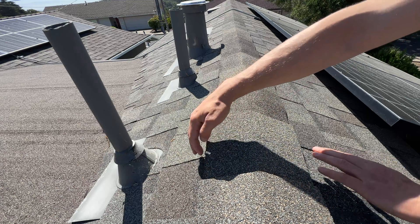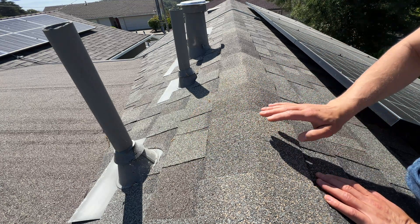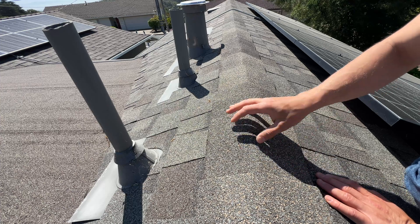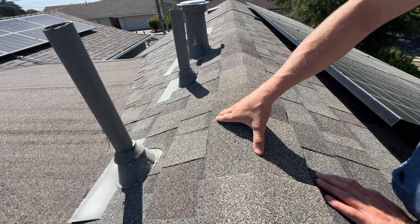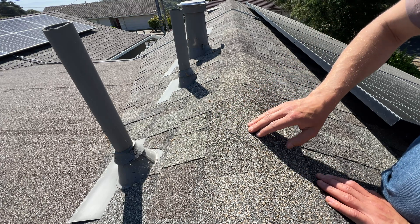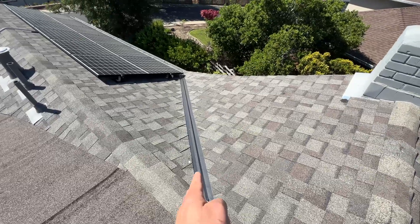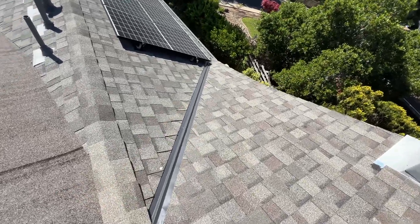The first area is the ridge of the roof. Underneath we have two pieces of plywood, then we have paper going around them, and then we have this cap. This cap is really soft material and it's usually unsupported. If you step hard enough you can damage this cap and also damage the paper going around this ridge.